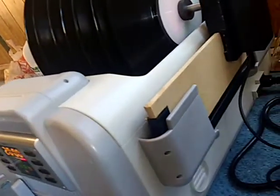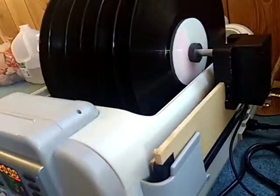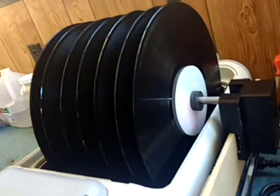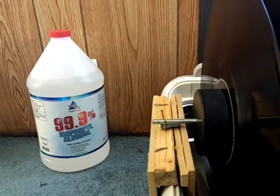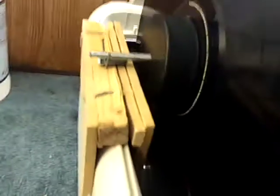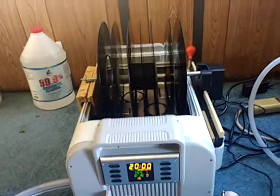There's a nice little holder built into the tank for the lid. I cut some wood to the right thickness and height so the motor sits on it perfectly, then built a quick little bracket to hold the other side of the spindle. It rests on metal rather than wood — for some reason it wasn't turning when resting on wood, so I put a coupling underneath and now it turns fine.